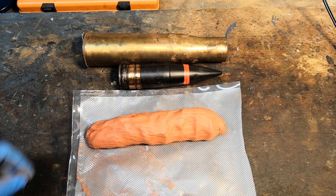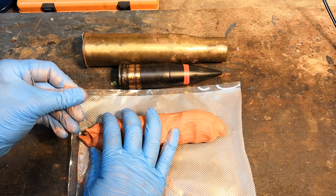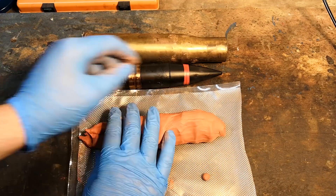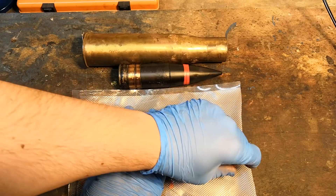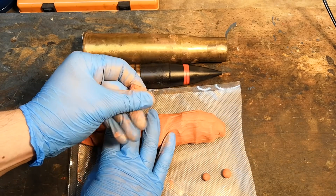For a given composition and pressure, the flame front velocity is fixed, and with the typical values encountered, it wouldn't be fast enough to generate the gas necessary to keep the pressure high. To solve that, we need to increase the surface area of our propellant, and the best way to do it is to split it into many round or cylindrical pieces, which are going to be the many different grains of our powder.